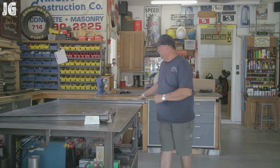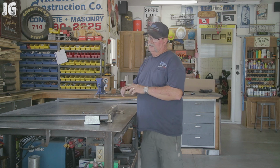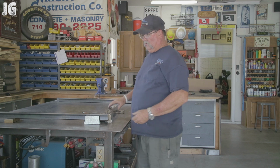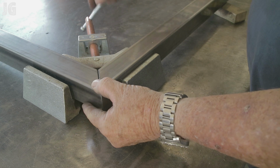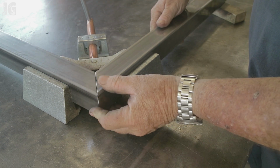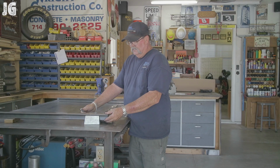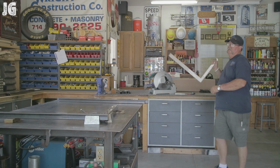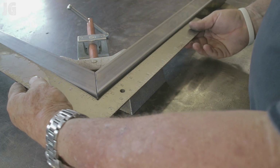This is a 1 inch offset right here, so I got a couple 1 inch spacers. I just got some wood spacers. Just lift this up like this, and this up like this. Now you could use anything you want, but once you do that, you just slide everything into position right here and get it as square as you can. And when you tighten the vise, it squares everything up perfectly. And there it is, providing your 45s are cut nice and clean. And these look like they are, and I've tightened the vise up a little bit, and look at that, perfectly square.